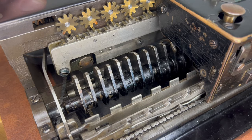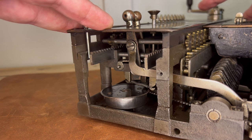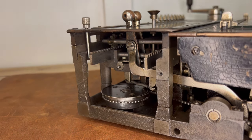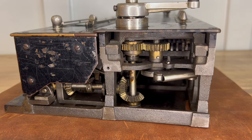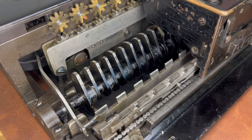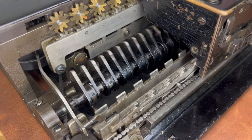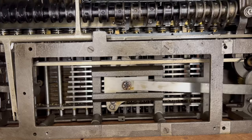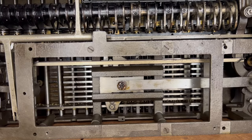Here I'm activating the add-subtract lever. The spring inside that drum brings the carriage back to first position. Those intermediate gears jump up and down, which is necessary to allow the carriage to shift without needing to tilt. This machine only really adds — here are his proportional gears in addition — and when I switch it to subtraction, the gears will add the complement 9 numbers.